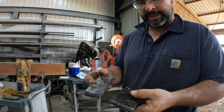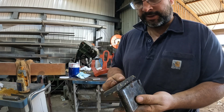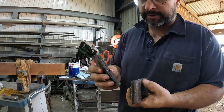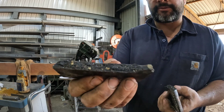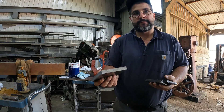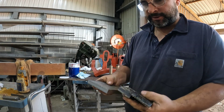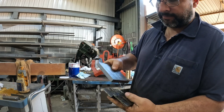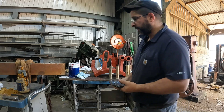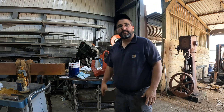This is one of the packers that runs behind the main bearings. As you can see, that's decided it wants to be two pieces — no idea why. Looks like a nice bit of wrought iron; see the grain structure in it. So I've found a bit of gauge plate and we're just going to make one of them up quick — mill it up square. I'll take you in and show you the engine, show you where it's going to go and what it's doing.